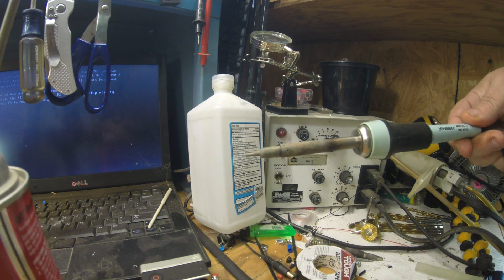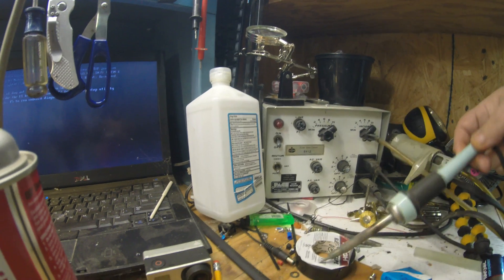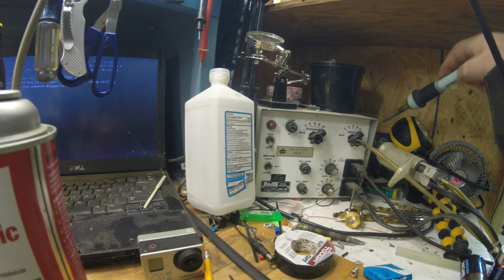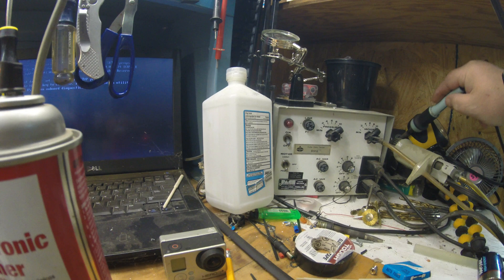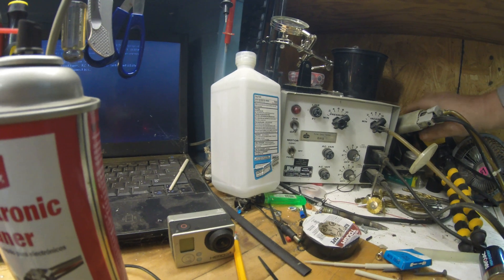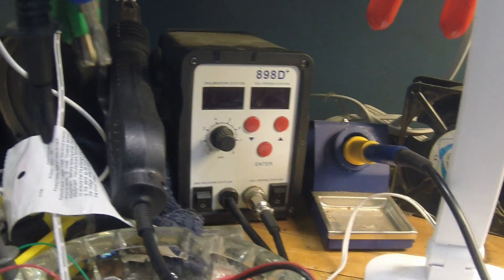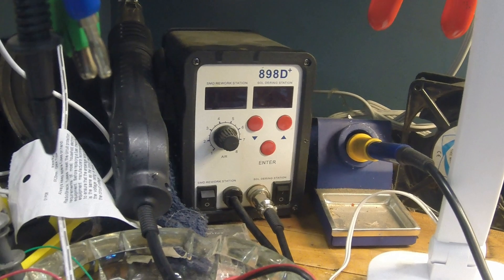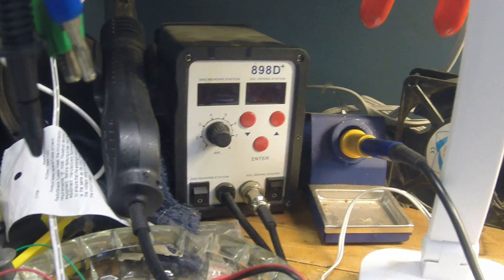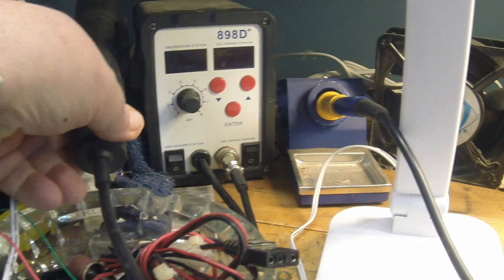It's got a nice soldering iron. It basically uses these Jensens that I have here, and these are cool because you can unscrew the element right in and out, kind of like a light bulb. It's really good for working with the solder station to soften some solder around. It's not my go-to for component repair, but it kind of fits with the station. Then I have my hot air station here, the 898D, which is just a Chinese knockoff. I mainly use it for shrinking heat shrink and I don't do much SMT work, but the main reason I own this one is for the hot air gun. It definitely has its place.